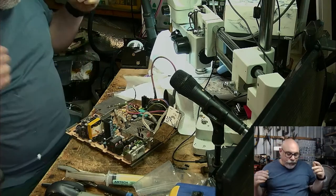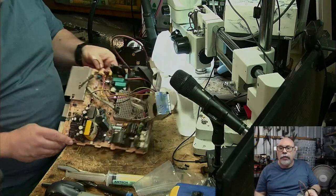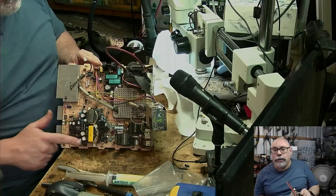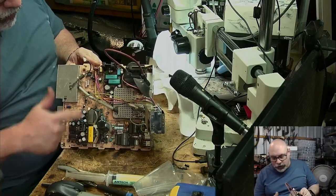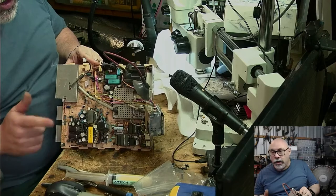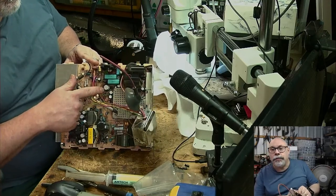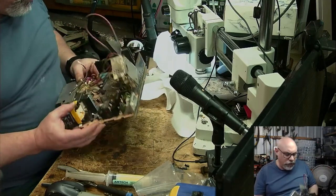Okay, all right. I'm just going to have a quick little talk about some of the problems that you do encounter with these analog boards, the things that do generally need to be sorted out. These caps here have a high tendency to leak. These ones here. So those are ones that I would typically go and replace. But I'll tell you another one, which is a shocker, is this guy here. It's a little flat one, a little squishy one. It's like 3300 or something like that.